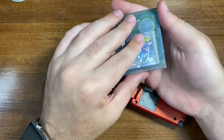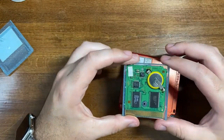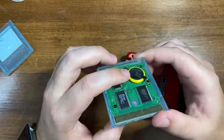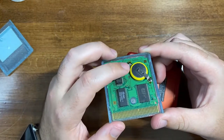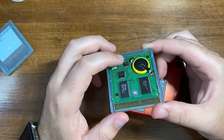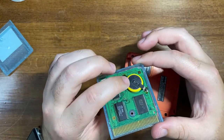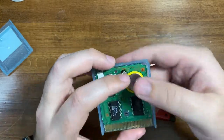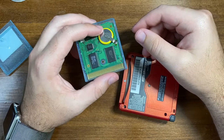The top part then slides down and off and you have the bare board. Before we start, you need to make sure you have the right battery. I believe this was a CR-2025. Different game carts take a CR-2032 — just make sure you have the right one appropriate to the cartridge beforehand. This one says 2025, and I believe Game Boy Advance cartridges use 2032s.